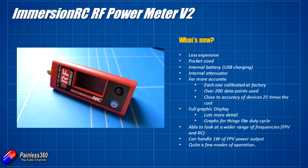This new one is far more accurate than version 1, and that's due to the fact that the attenuator is internal. Because of the manufacturing variances of those original attenuators — even though they were manufactured in the USA — each version 1 could be a little bit out. But the version 2s are calibrated in the factory against an NIST-certified device over 200 data points, so they're pretty spot-on to about half a dBm.